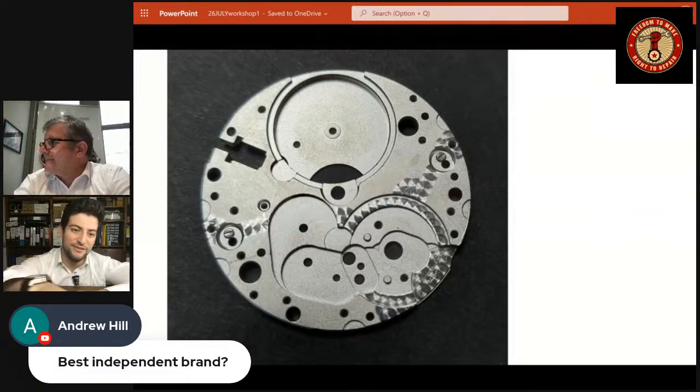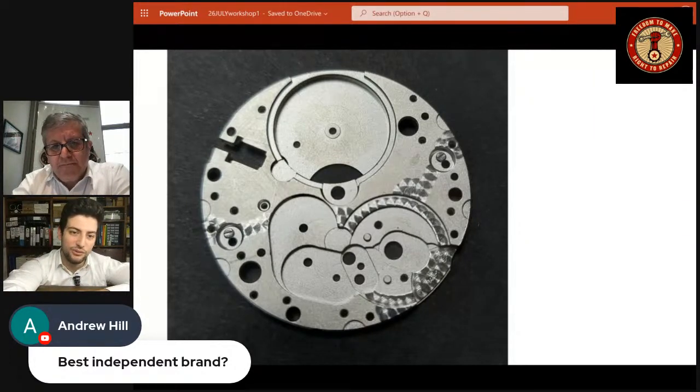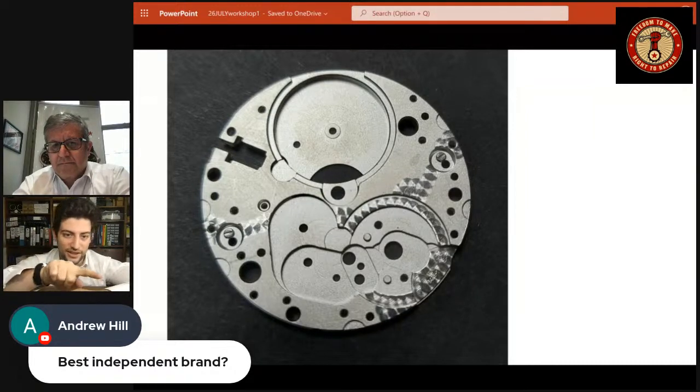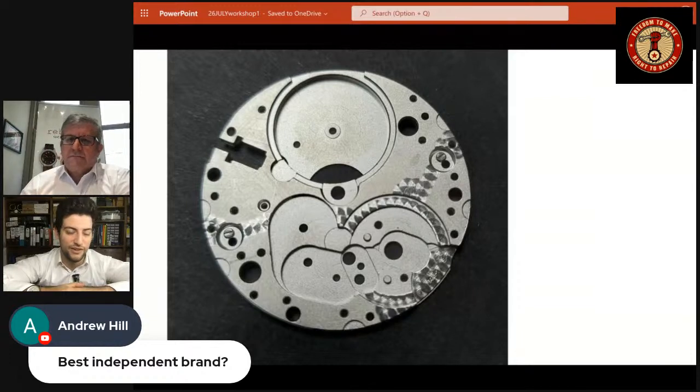So basically, if you have your barrel bridge over the barrel, which is the upper half of the movement, it will cover all of that non-perlage section. Then you have your train bridge on the lower left side, and that circular area on the lower right side without any perlage is where your pallet bridge goes. All of those areas will be covered up by bridges, and the gap between the two bridges, probably only 3 or 4 mil wide, you'll be able to see down to the perlage, and that's why it's in a seemingly random line. But that very most likely would be done by machine. Yeah.